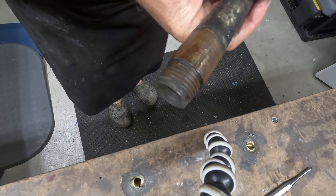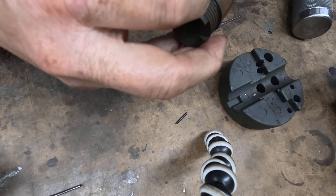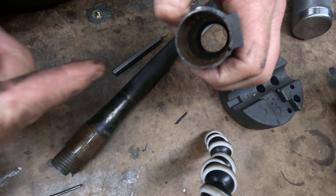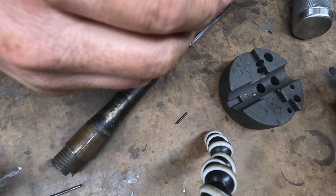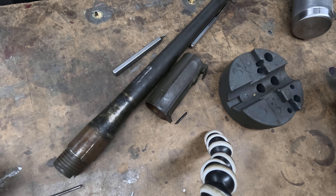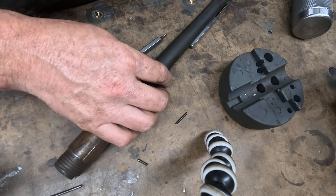Here's where I was talking about how they drilled them parallel with the bore. You can see the pin fell out on the floor. This is a really weird angle — it's compound, and you could never redrill this without a jig, something to hold your drill bit. But here's the pin itself. You can see how hard that drives on.